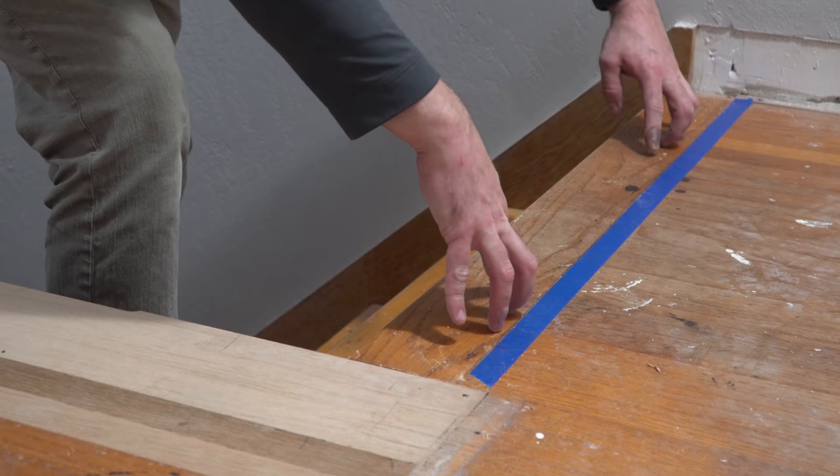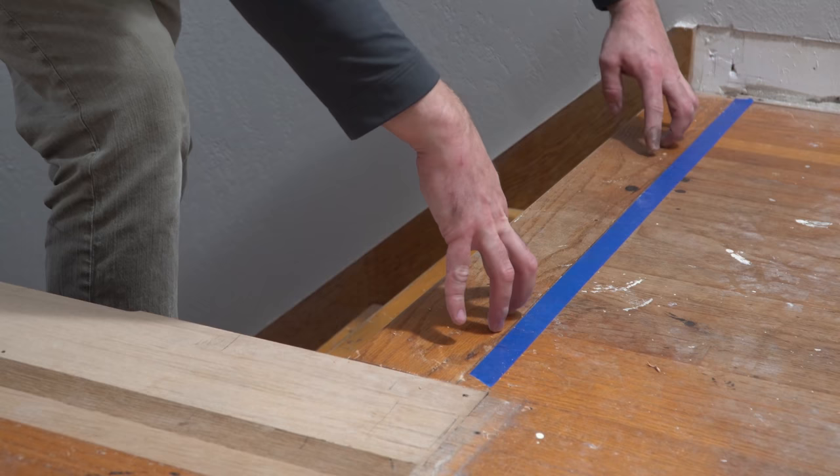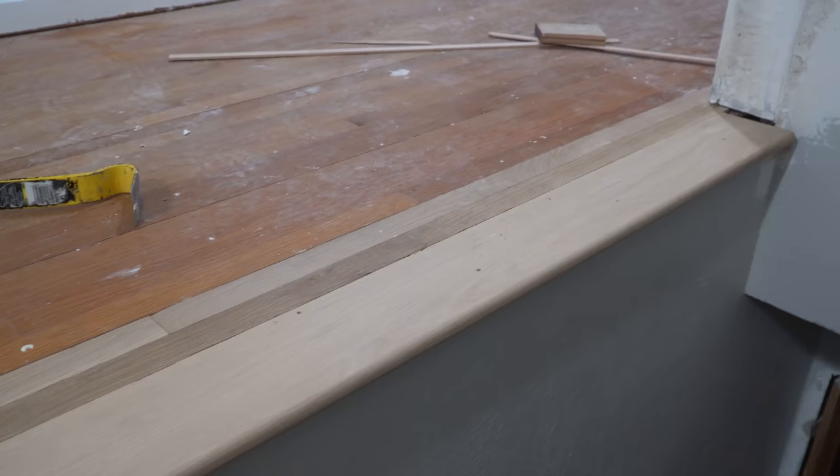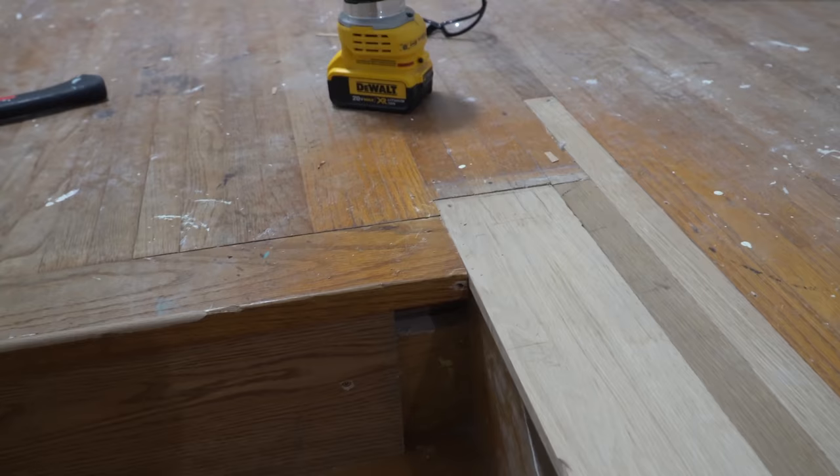This piece of tape is here and I've got it marked with locations of the nails that are in the subfloor, so I made sure I didn't put any of my new nails into those exact same locations — because if you get a nail in halfway through a board and then hit the next nail, you're not going any further. So now this board is not going anywhere and it looks pretty nice. Refinishing the floors will help a lot because they'll smooth out the rough spots and then all the finish will match, and the top of the stairs is right there too.